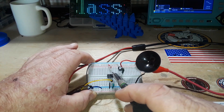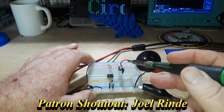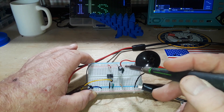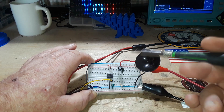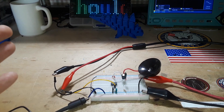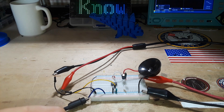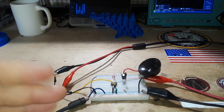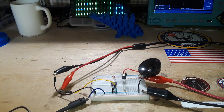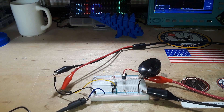Pin 5 is our output, and it is going over to this 220 microfarad output capacitor. It's also going through this .022 polyester cap through a 10 ohm resistor to ground, which is directly off of the LM386 data sheet. When you're wanting to know about a new circuit or work with a new component, your first place to go is the data sheet — just Google 'LM386 data sheet' and you'll get about a 10-page document with everything you've ever wanted to know.